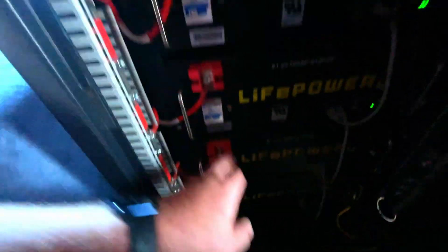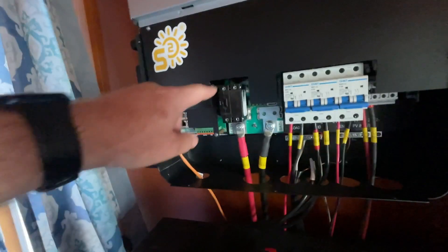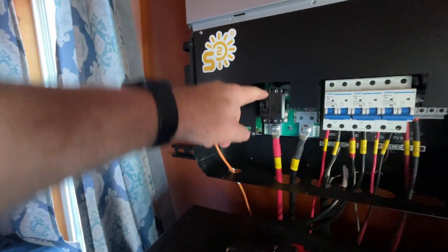So what we're going to do is make sure to shut down our battery bank as well. There's one, there's two, there's three, there's four, there's five, and there's six. All of our lights on our batteries are not on anymore — no SOC, no online. The batteries are shut down and the inverter has followed. For good measure, we're going to go ahead and turn off the battery breaker as well, just to double-check it for safety, because we don't want anyone getting electrocuted.